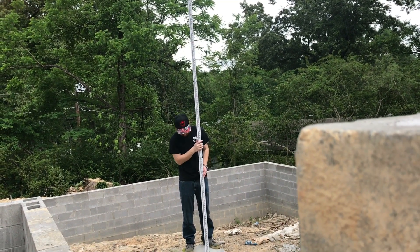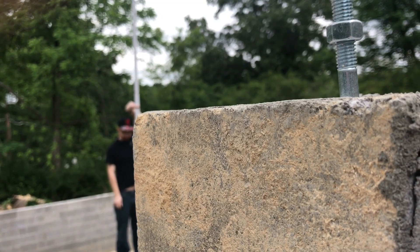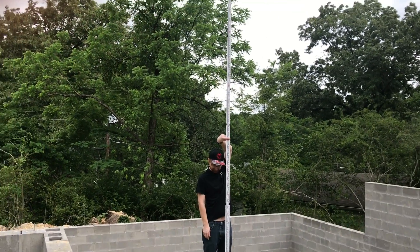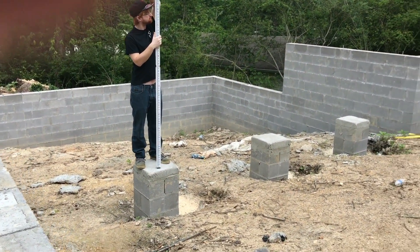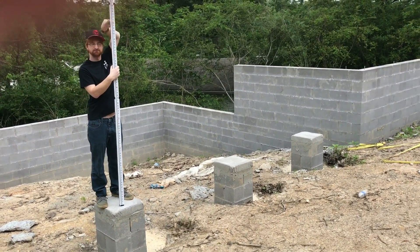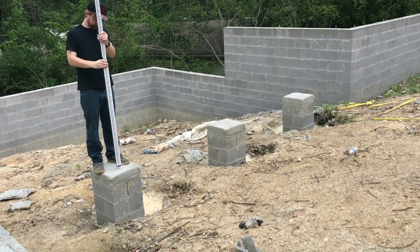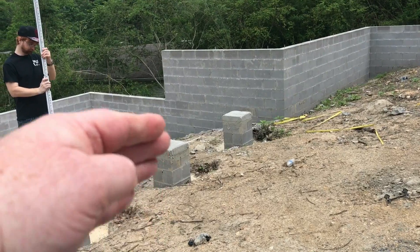Hold your finger at six feet - we're going to line this up. It's a little under six feet. This is called the transit. I eyeballed it at five foot eleven. We're just trying to figure out how tall our steel columns are going to be sitting on top of those piers. The reason we have to do that is because once the pier gets up above six feet, you have to pour it solid with concrete. Steel columns are better anyway, so what we normally do with really tall columns or piers is put a base to get them up out of the ground and then build a steel column from there.